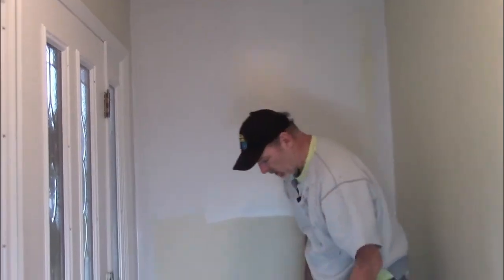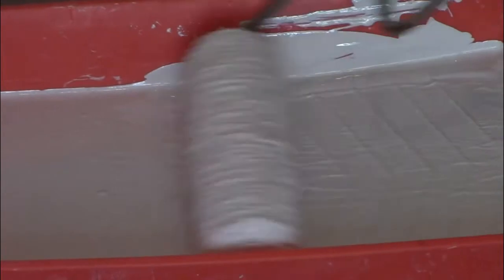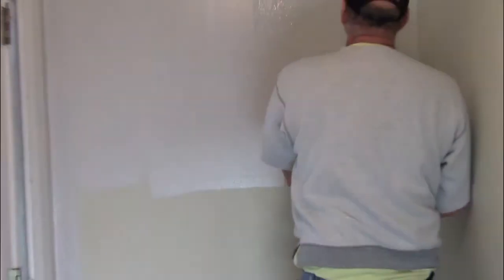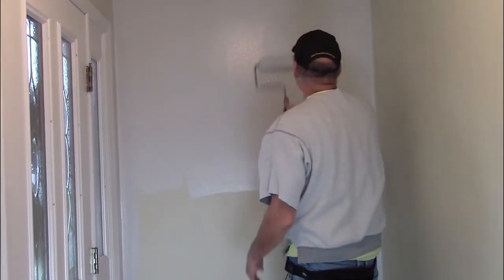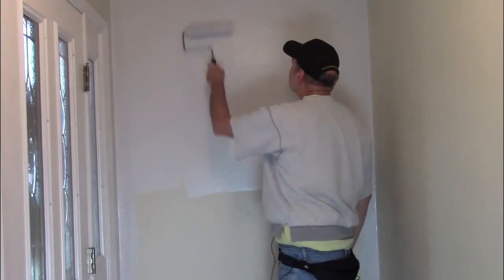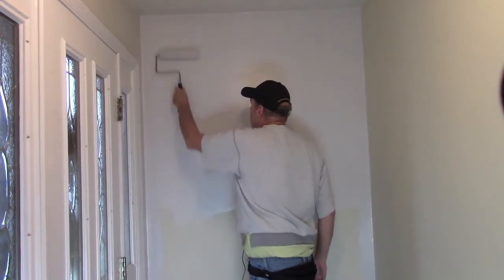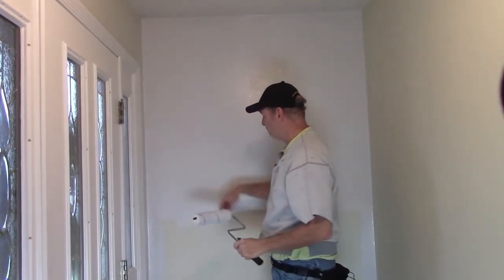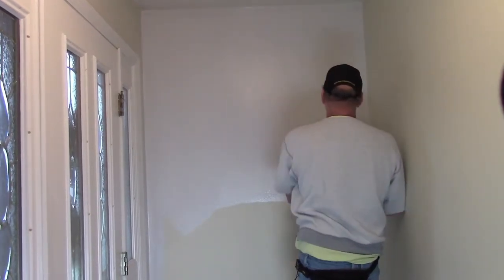You can see that didn't go very far. You go by sound and look to know when you're going to have to reload your roller — just like the brush, it'll sound dry. When it's dry, go get more paint. You might be inclined to just press and get more out of the roller, but all you're going to do is give yourself lines — fatty edges, we call them — and that's not going to look good in the end.